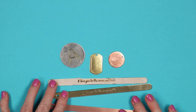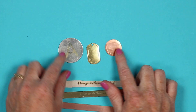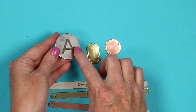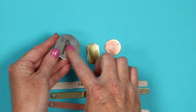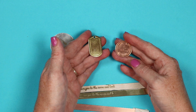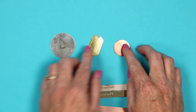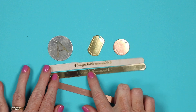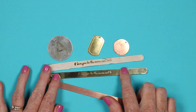Since those examples were with my Glowforge Spark, which is about 6 watts, I also tried my XTool 20 watt diode laser on a few different blanks. On one blank it did mark — barely visible, just removing some coating — and you can't feel it at all on the surface. However on two other metal blanks, using the exact same settings, it did nothing at all. So with a diode laser you can get very inconsistent results — something might work but skip places, giving you an inconsistent etch on metal.